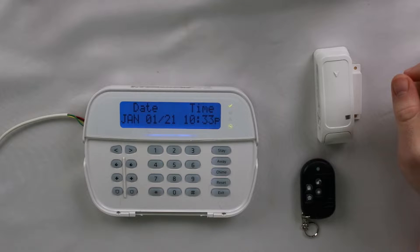One other thing to consider before clearing these tampers: if you put your sensors up and they start showing the not networked trouble, it means that wherever the device is located, it cannot get a good signal. So it is a good idea to grab your sensors and bring them closer to the panel if you're running into this trouble, especially if you did enroll them using the auto enroll as recommended. If you see it again after you have enrolled them properly and gotten them to connect once, just know that it's probably in a location where it's not going to work.